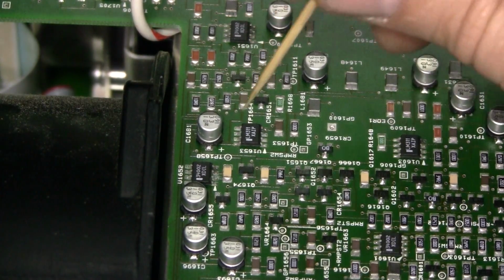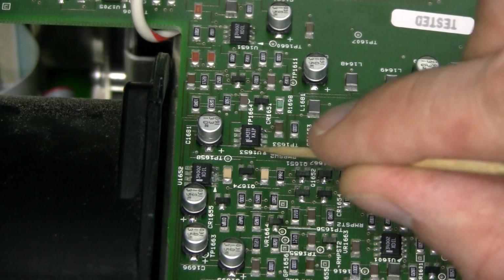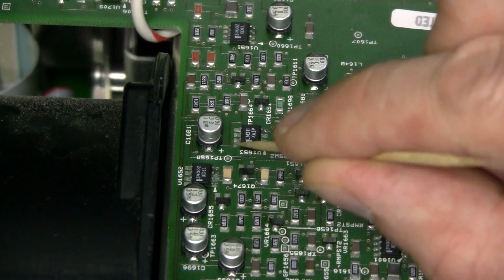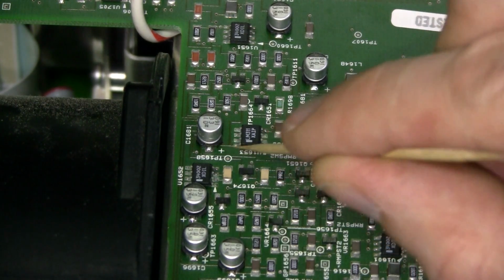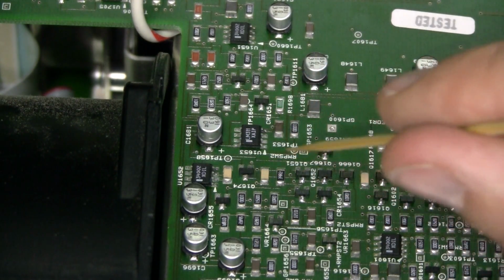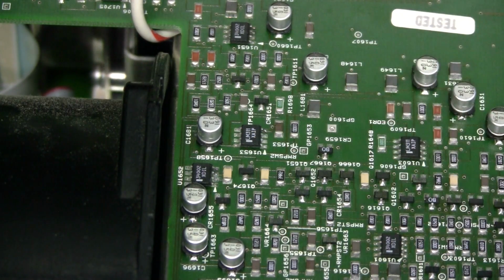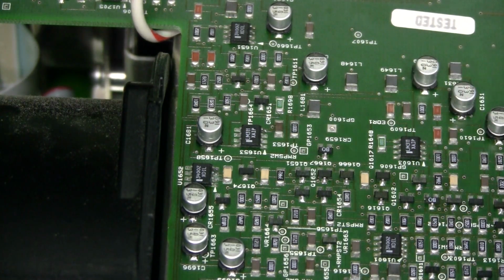And the second problem is around here. Pin 8 of this op-amp is connected to the positive 5-volt rail, and I checked the power is present here, and there is a trace to the positive pin of the capacitor, but there is no connection and there is no voltage across the capacitor. So it seems to me that the only consequence of this is that the bypass capacitor is not connected, so it can lead to some noise on the 5-volt rail around here.